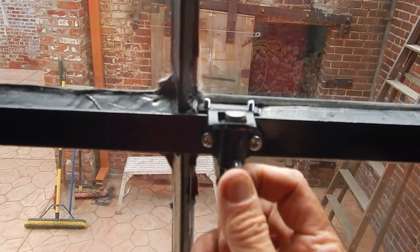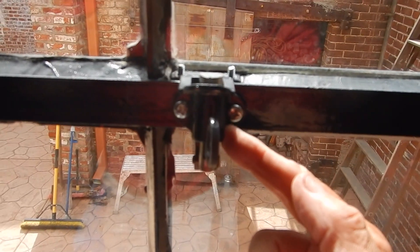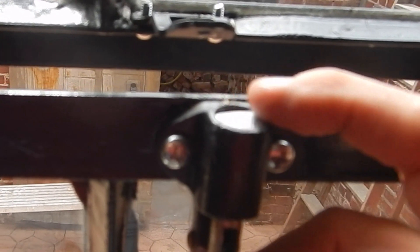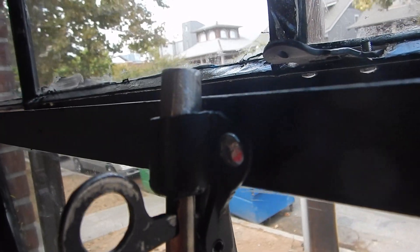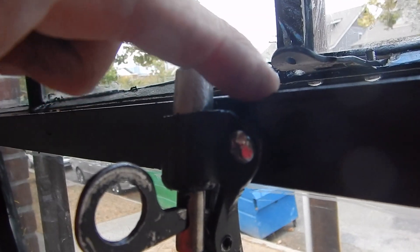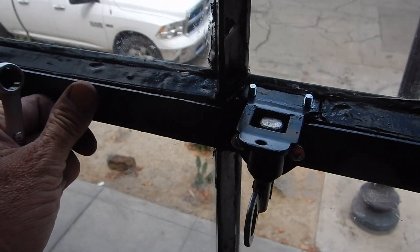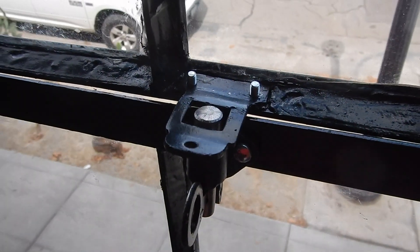Okay so this is what it looks like installed. This is the cast iron one — what we discovered is that when it's open the top of the bolt had to be even with the top of the latch. I had erroneously assumed the other two were going to be the same way. In this one the top of the unit is below the top of the window, which is different from the other side. But now that I've increased the length of the bolt — and there we go. What I find really comical about the situation is the reproduction parts, now that they're fit, work better than the originals. Anyway, that's all for this week. Thanks for stopping in. I'm happy to answer any questions in the comments below, so please like, comment, share, and subscribe. Click up here to see my last video, click over here to see something YouTube thinks you'll like, and have a good one — I'll see you next time.